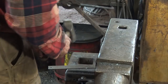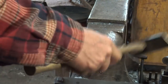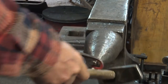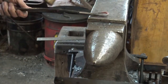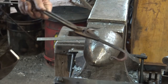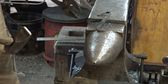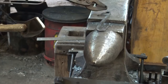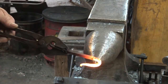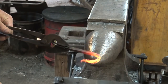There's another nice little curl on the end — now we'll heat it up and do the hook. I've cooled the curl off just in case I hit it with the hammer. You want these hooks to look the same. If you're going to make a whole bunch of hooks, it's worth making a little jig for, but to do just a handful, it's better to learn to do them by hand and by eye. There is a completely functional S-hook. The ends aren't quite the same — I'm going to put that back in the fire and make that just a little bit bigger.